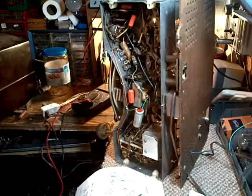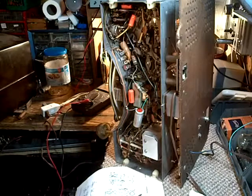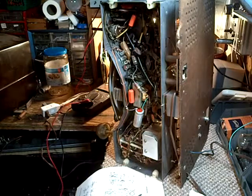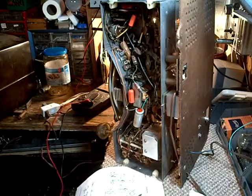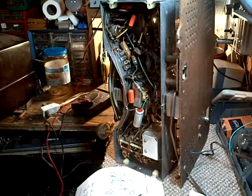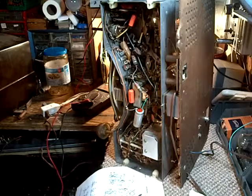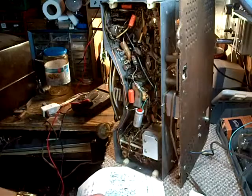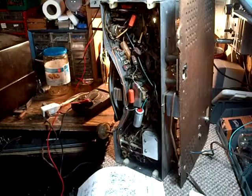In terms of hum performance it's greatly improved. I can still hear a bit of a low hum, so it might have to put in a little more — a few more capacitors. It was a four-section power supply capacitor here and I've only boosted up the one section. The disappointing thing is it doesn't seem to be receiving anything, so I think I'll make that the topic of the next video. Thanks for watching the capacitor installation and test.